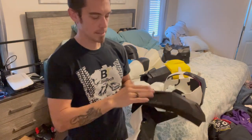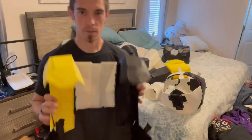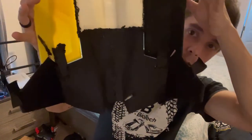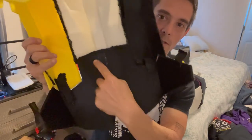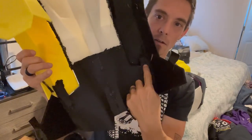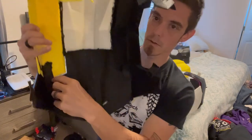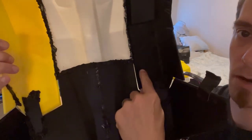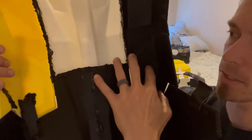Here is the back piece. There's still some cleanup I have to do. What I wanted to do right off the bat is start reinforcing — you can see on the inside there's a lot of reinforcement going on: a lot of welding. This is all pretty much one solid piece now. This was split in half and merged back together. I've also taken some scrap pieces from pieces that broke and basically made reinforcement areas. I looked to where there were openings and just wanted to reinforce them. I'm going to take more PLA and completely seal this off, and then this whole thing will get fiberglass.